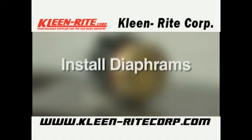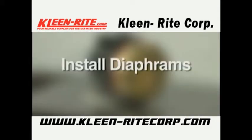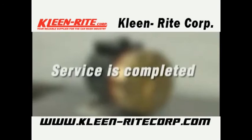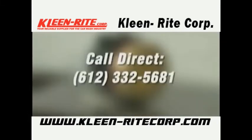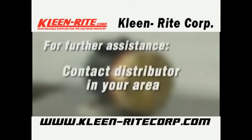Install the diaphragms as described in the 'Install Diaphragms' section of this video. Install the fluid end of the pump and prime the hydraulic cells as described in the fluid and service section of this video. You have now completed service on the Wanner Hydra-Cell HG25 pump. For further assistance, please see the troubleshooting section or call Wanner directly at 612-332-5681. Visit our websites wannereng.com or wannerint.com for European customers, or contact the distributor in your area.